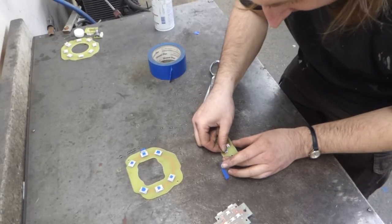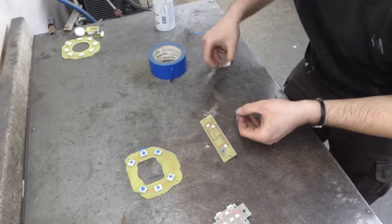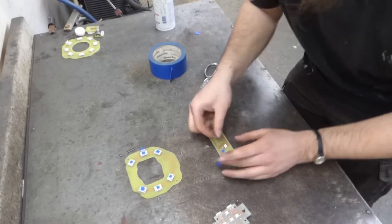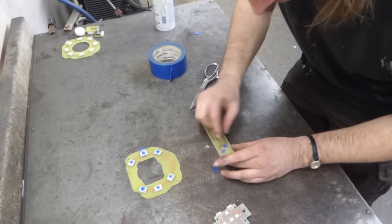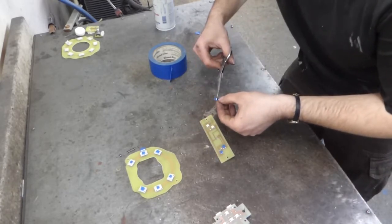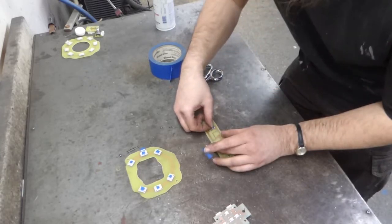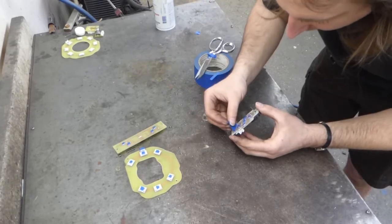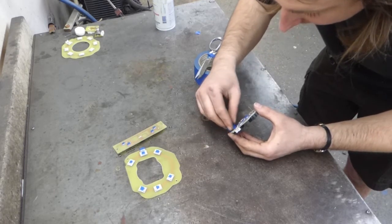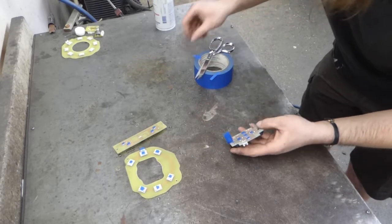These boards need to be conformally coated to seal them against a rather hostile moistness of behind a dash. So I am just first masking off the LEDs because the conformal coating, if it gets on the lenses, tends to make them really blurry and dim. Now this coating will also immobilize any moving part once it's dried, so got to mask off the motor shafts as well.